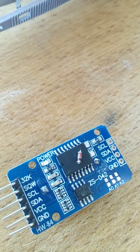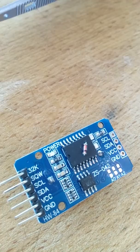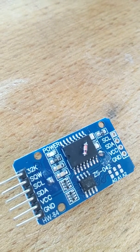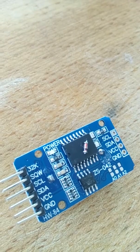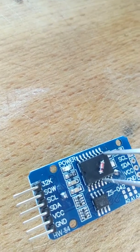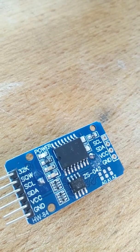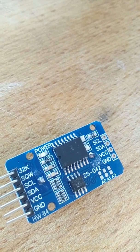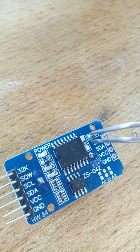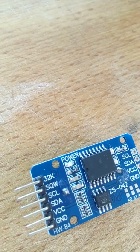You see, once it's off it's going to work fine. I had this problem — the watch was not working how it's supposed to, just going back or resetting. After two months and a lot of resets, I took this diode off and actually it's working fine. This diode connects the circuit to charge the battery, but my battery is a simple battery.